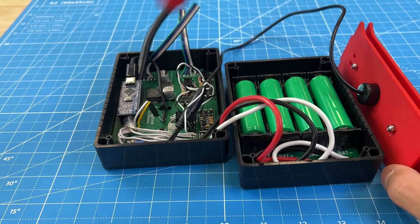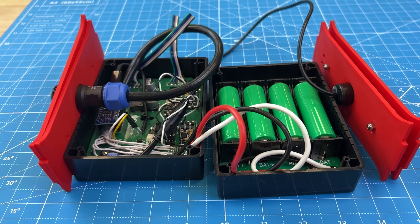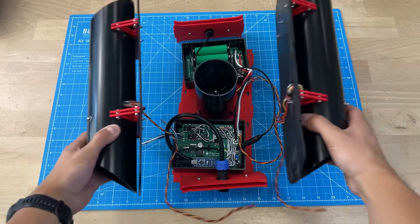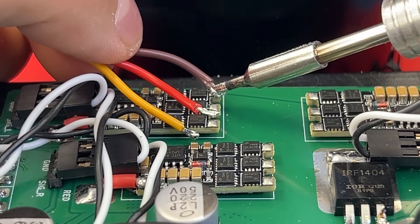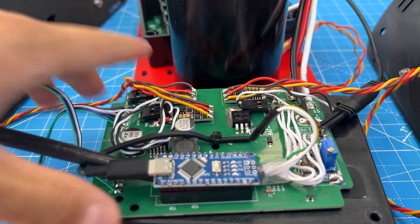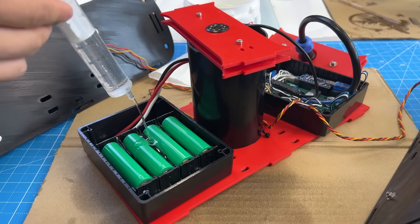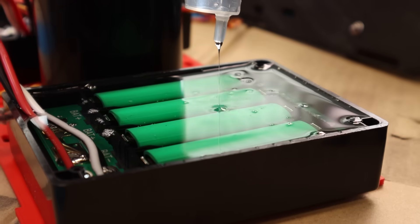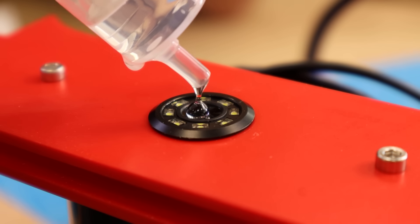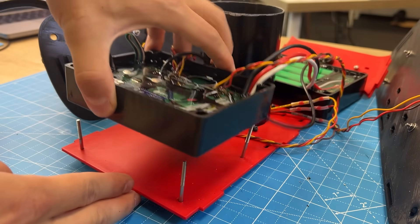It's finally time to make everything waterproof. This time, it's quite straightforward — we'll use epoxy resin. We need to mix the correct amounts and pour everything into the boxes. The only downside of this method is that if something inside the epoxy breaks, we'll need to replace the entire board. But we made sure that doesn't happen by limit testing everything. And you can still reprogram it after, if needed. On the upsides, it's fast, it's cheap, and it's durable, because it could theoretically work very deep underwater.